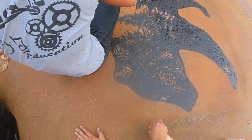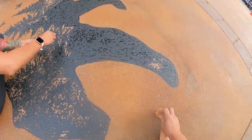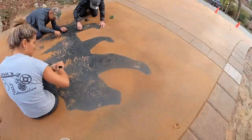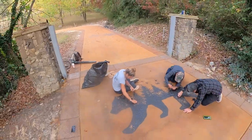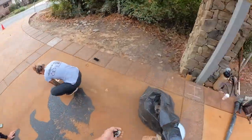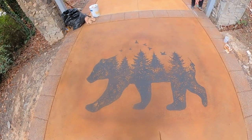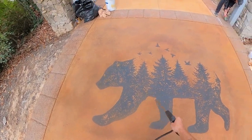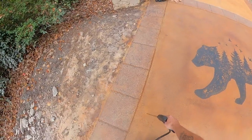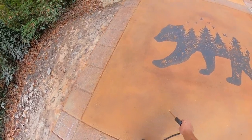You can kind of see an outside square ring around it. Brittany, Josh, and Sergio are removing all those little pieces we had to leave in there. Once again the acetone worked really well — a good tip to put in your toolbox. If you ever get acetone dye on anything, just take acetone and it will help lighten it up. I'm not going to say it's going to remove it completely, but then I'm going back over it with more of this exterior acetone dye to try to darken this particular square up.